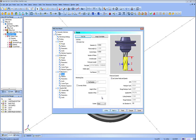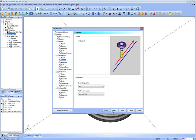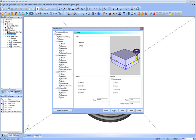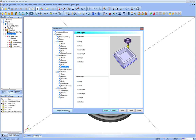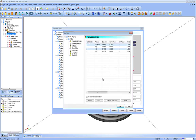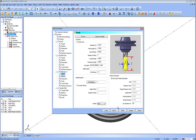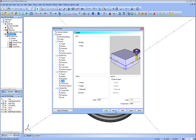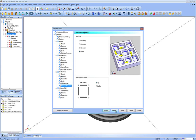Now for the finish tool, I'm going to go into my tool crib and library and pick the 375 end mill. I'm not going to assign a holder to this one just so you can see the difference. Tool 4. We're going to turn on both compensations — machine and system. We're not leaving any material for finishing because we're finishing it; we're taking it in one pass, though you can step it down if needed. I'm going to do a circular lead in and out of maybe 60 thou. Default corner types and closest on the machining sequence. There's a useful button here — if you set a page and that page is appearing in the other operations, hitting apply to all operations will set it to the others as well.